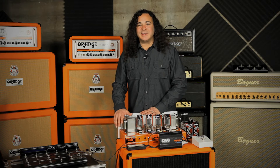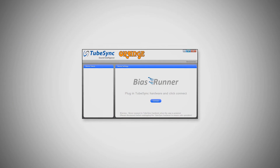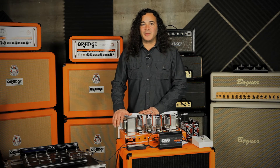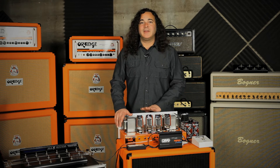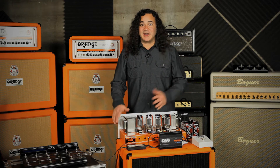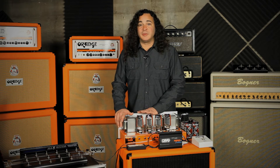The OV-4 can only be installed by an authorized Orange service center, but the setup process takes only about an hour — it's pretty straightforward. Your tech is going to run a piece of software called Bias Runner to set two key modes for your amplifier. The first is Active Mode, which is where the amp is actually playing and will have a higher bias, and the second is Idle Mode, where your amp is just sitting idle. That idle mode is actually going to allow you to save a lot of tube life on your amp.